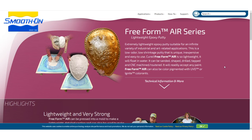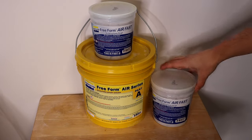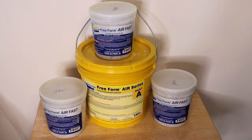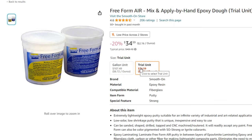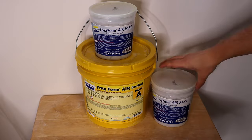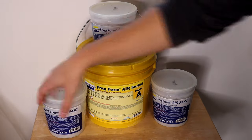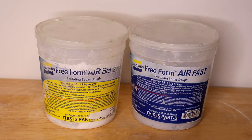Freeform Air is a product by the company Smooth-On. It comes in a trial unit of 1.8 pounds or a gallon unit of 6.8 pounds. The trial unit ranges around the $35 range, whereas the gallon unit ranges around the $110 range. I bought the gallon because I use quite a bit of this stuff. They send you a gallon of Part A and a bunch of tiny containers of Part B, because Part B is the fast part. Part A is the same for all Freeform Air products; Part B is either fast or regular, as it's the hardener that creates the fast or slower reaction.